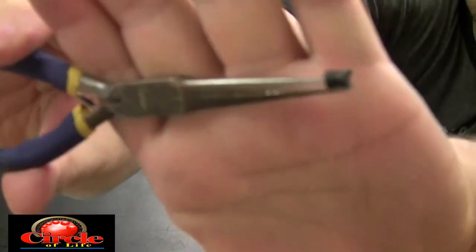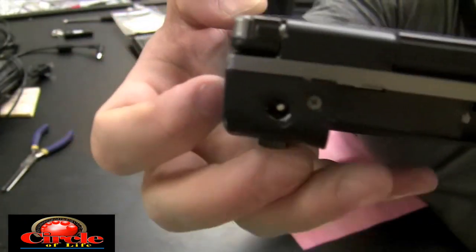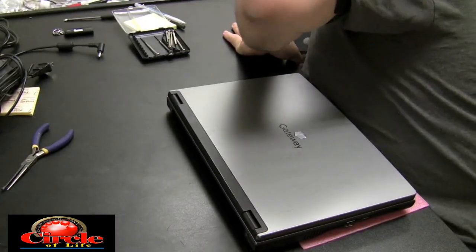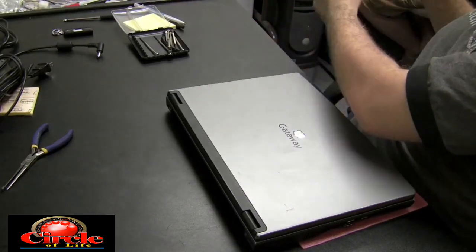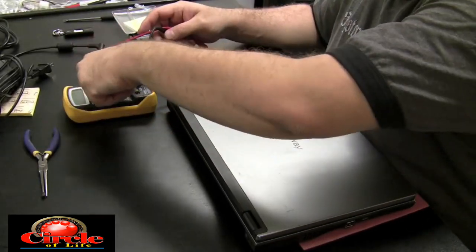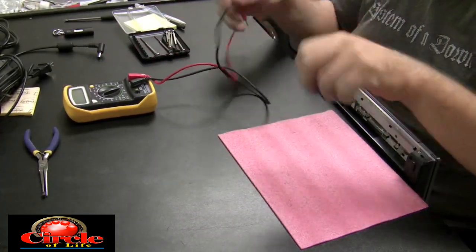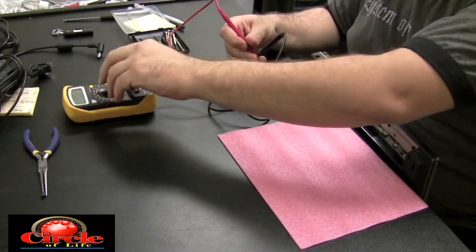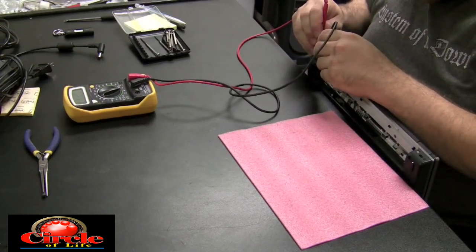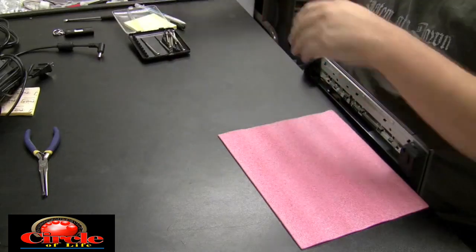Here is the culprit. Now the inside of that jack is clean and clear. I'm going to take my voltmeter out to make sure nothing got damaged in that jack. I'm going to check for any short circuits by setting the meter for continuity — that's where you hear a little beep. I'll touch the inside pin of the power jack and a ground point, and if I hear a beep then I know there's a short circuit. It looks like it's okay.